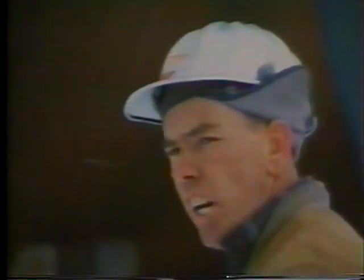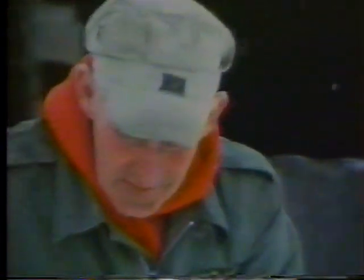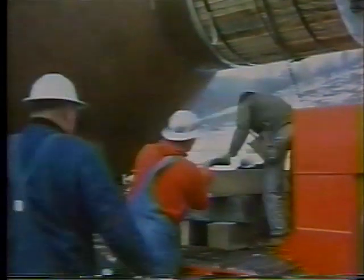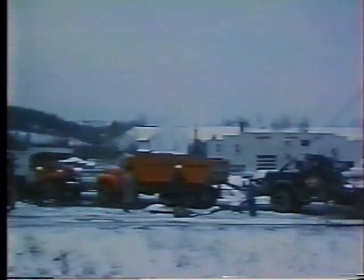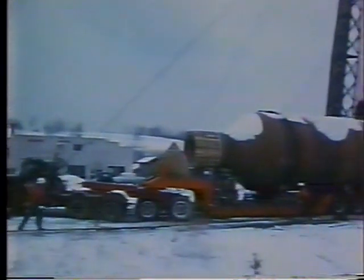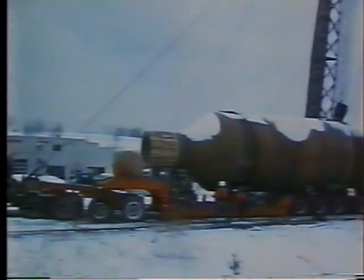This shaft is a combination of A201 steel plate up to 6 inches thick, welded to two 3.5% nickel steel castings. It is finish machined to tolerances within 10,000ths of an inch. While it was not the most concentrated weight, it is a very costly piece and a most cumbersome component to handle. It was brought to the site with 2 tractors pulling and 1 pushing. Here it waited for receipt of the sphere, which was still being machined at the fabricator's shop.